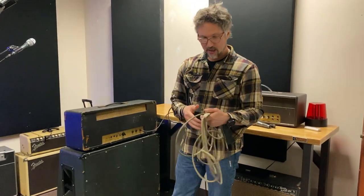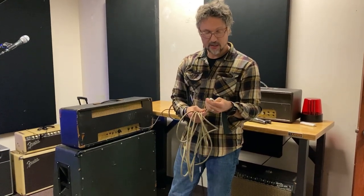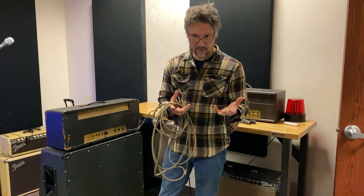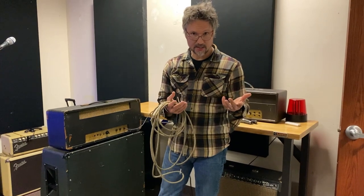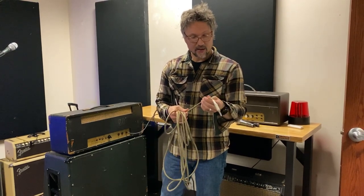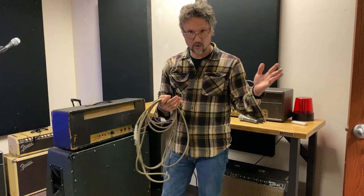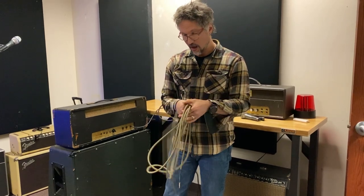This instrument cable has a smaller copper wire and it's also shielded. A guitar has basically a pickup — and even active pickups are not putting out very much signal. It's called a high Z signal. Instrument cables are shielded because the wire is so small; if you don't shield it, you literally get all kinds of electromagnetic interference, like radio waves coming through the instrument cable.